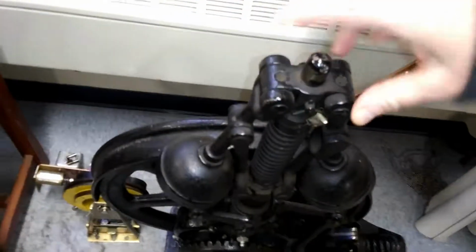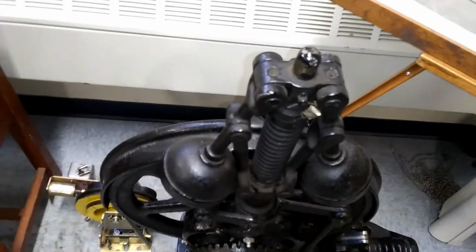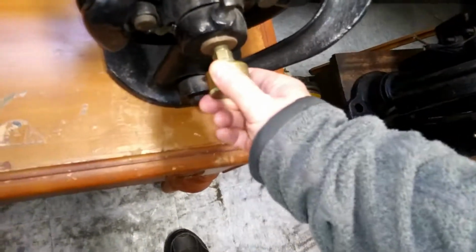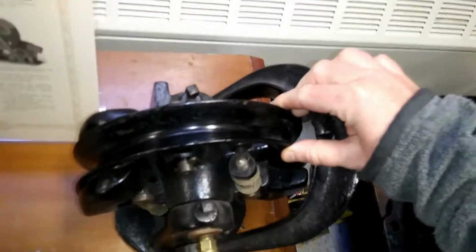Ball governor. When the wheel turns too fast, the elevator moves too fast. If the elevator moves faster, the balls are pushed out by centrifugal force. Then, if it goes too fast, the balls at full tilt hit a switch, and it'll stop. What's this thing here? Oh, that's a small winch. Same thing, but in a different way.